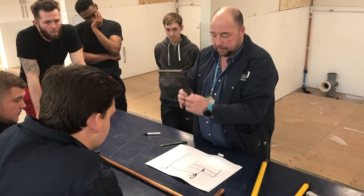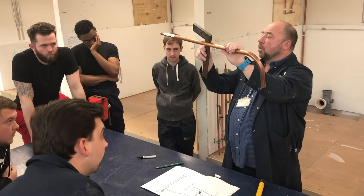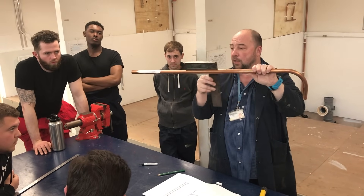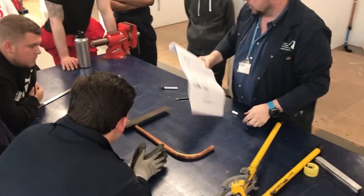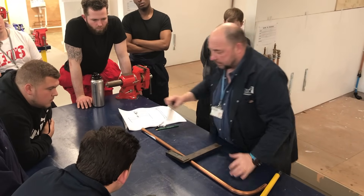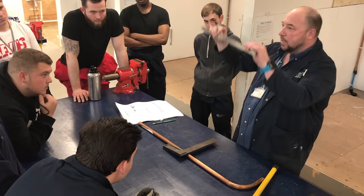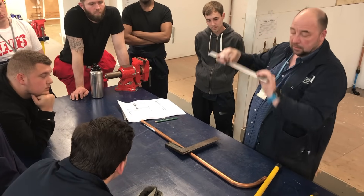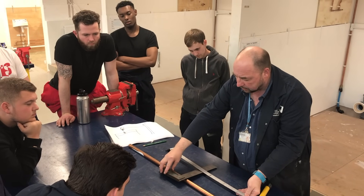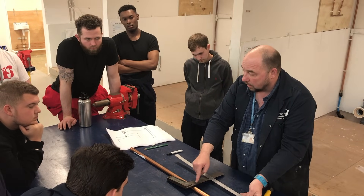What we're doing is making a centre line, and a new centre line that's going to come down measured 300 millimetres. Get yourself a square, and the square needs to mirror the bend of the pipe — you can see it's coming down just like it is at that end. Do not put the square at an angle off the top of the pipe — it needs to be square so you can run it all the way along. The easiest way to do that is put it on the bench. If you can't see it, mark it. Laying it on the centre line, you can then move the square until that line is in line with the square.